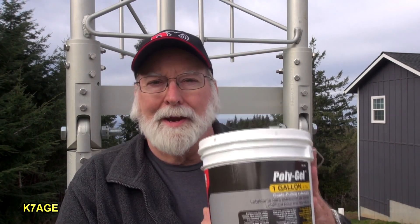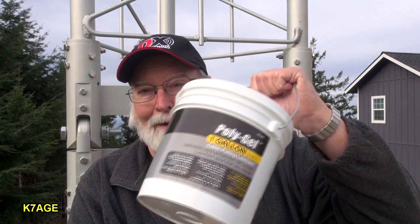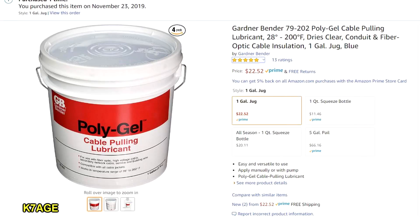I've got nine cables to pull through about a hundred and seven feet of conduit. A couple quick suggestions were: you got lube? I got this on Amazon — it's polygel. I went to YouTube and looked at a couple videos of what other guys do for pulling conduit. They use the gel. One video showed them saturating a rag with this stuff, tying it onto a pull string, pulling it through, resaturating it, pulling it back, doing that a couple times to get the pipe greased up. That's what we're going to start with here today and see how it goes.